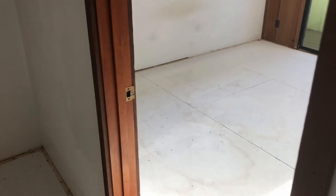Now there's an echo in here. This one had a nice stain too — you can see them in the sealer, but now at least there's something on the floor. I can see all the staples now that it's white; before it's harder to see them all and pull them. You want to get all the staples, all the big spots sticking up, because the staples will stick to the bottom of the plank and make a clank.